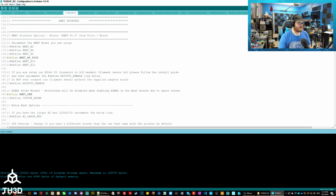So what you need to just make sure now, I did not update in here to use the OptiBoot, because what happens is if you flash an OptiBoot firmware on people that are using the 1.0, which is what we had before, you're going to have problems. You're going to have to reflash your bootloader, and I don't want to get a million tickets saying, hey, my board is just a blank screen now, because what will happen is you'll override the bootloader.